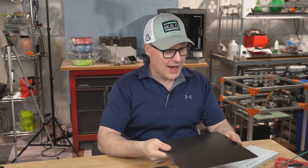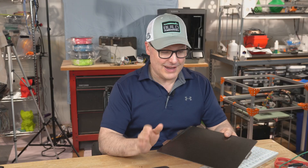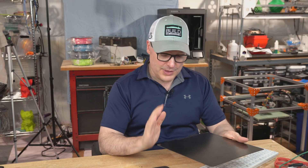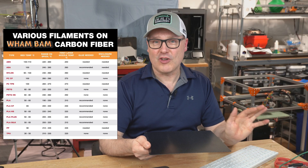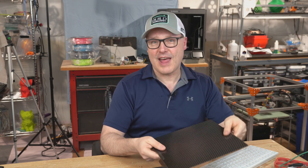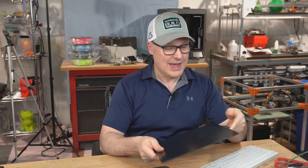Now at the pros and cons part of the video: I really, really like this. I like that it's a virtually indestructible surface — very rugged. It's got the spring steel I'm used to from all the Wham-Bam surfaces. And on their website they've basically given you all the information you need to be successful with this surface. Depending on whether you're printing PLA, PLA silks, ABS, ASA, polypropylene — you go to that reference chart and they tell you exactly what you need to do to make this work. I like it a lot.